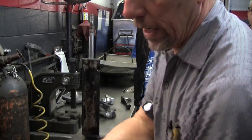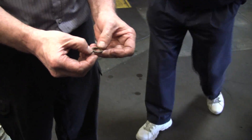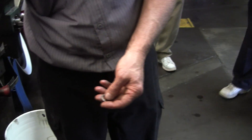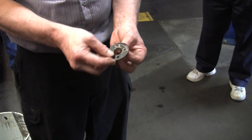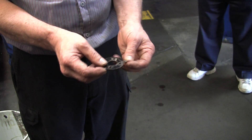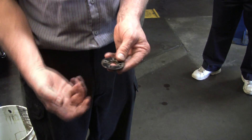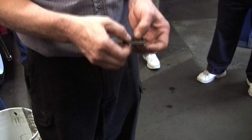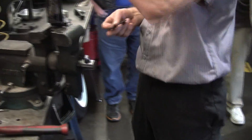So it does two things when you tighten that up. This washer has a flat side and a step-down side. The flat side goes down, the step-down side goes up, and then this is supposed to fit into there — not like this. So when you're tightening the screws, first of all you're pulling this inner housing up to the snap ring until it locks, and then you're putting an additional squeeze on that to keep the seal from rocking and moving around and hopefully compress it a bit.